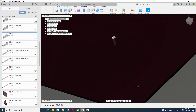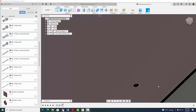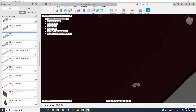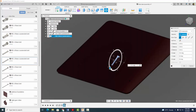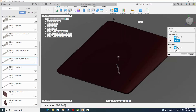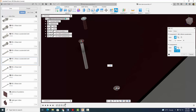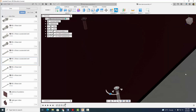Now I'm going to do the same thing over here, but this time I'm going to use a different size bolt. In this cone shape countersink hole, we want to insert our M3 by 30 countersink bolt. So I'm going to right click, insert into current design. And just like last time, I'm going to use a rigid constraint. I'm going to rotate it, kind of get it into position, select OK, come on up to assemble joint, use a rigid joint, click right there, and select OK.